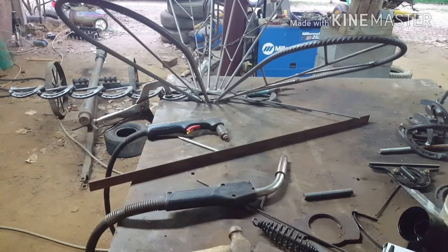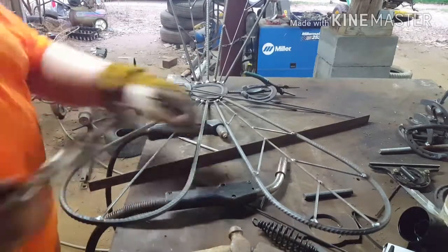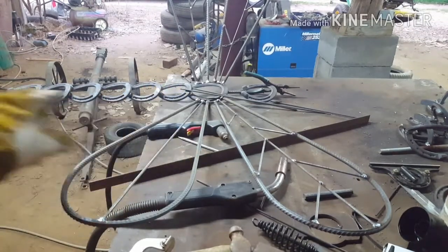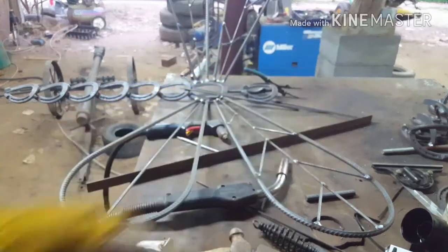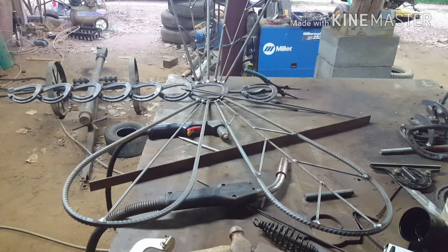I've got two - what I've been doing on the wings on him is kind of the same thing as the butterfly. But I staggered these rods in it down through there. I think it looks pretty good. I gotta add some legs to him. I'm sorry about not showing you the beginning of this. All I did was - this rebar comes in 10-foot sections. First off I made that body like I showed you on the last one. I cut the rebar in half, two and a half foot, and marked the center. And then wrapped it around my wooden post over there. When I wrapped it around the post I grabbed it on both sides and rolled it around and tried to keep it as even as I could. Because if you just fold it, it's gonna leave a point, and I wanted to keep it as round as possible. And I welded them on there.